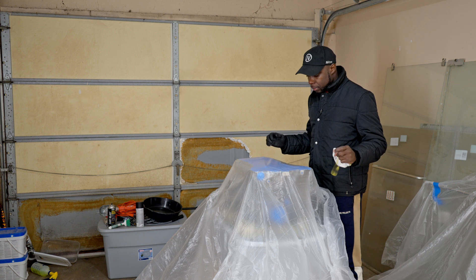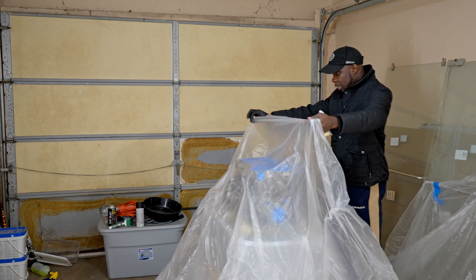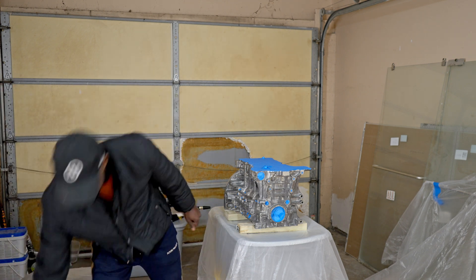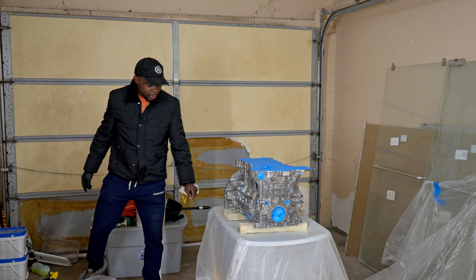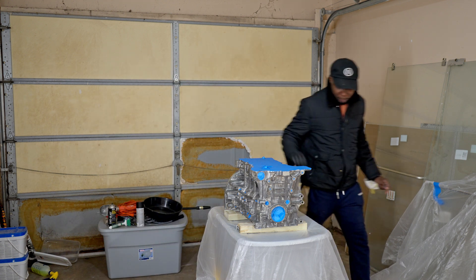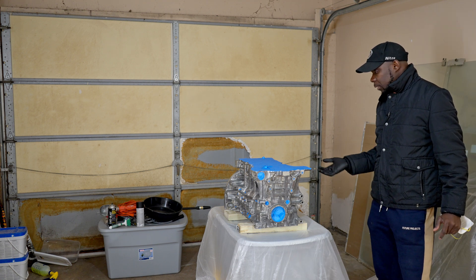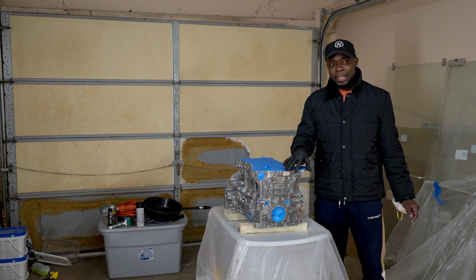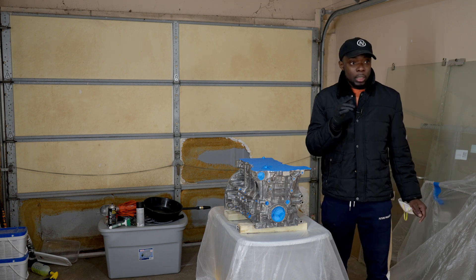After a lot of prep I'm ready to finally get this chapter finished and move to the next. You always have to prep when doing this job — if you don't prep properly you will get a very bad finish. I scraped the paint that was here and we are almost 90% bare metal. When you get to bare metal, you don't apply the final coat straight away — you first apply the primer, then the final coat. So let's start with the primer.